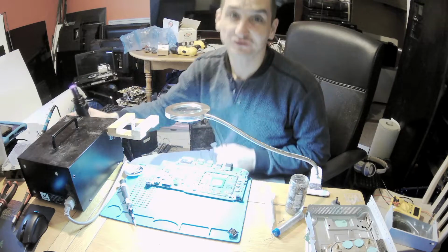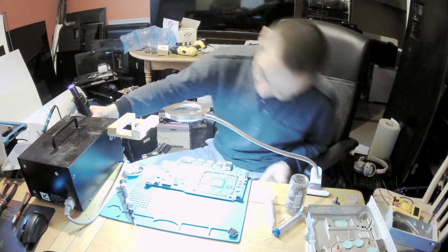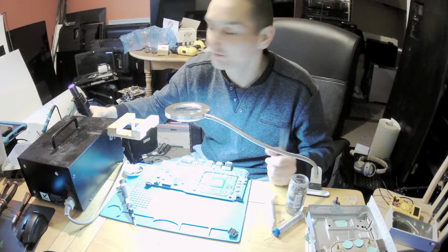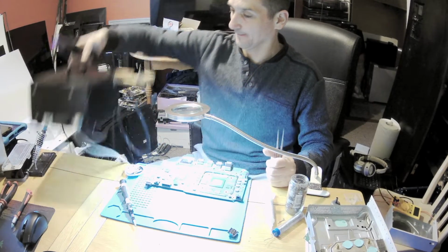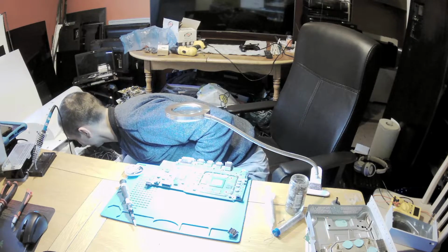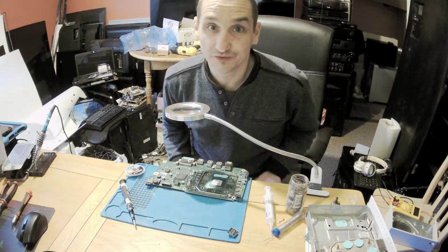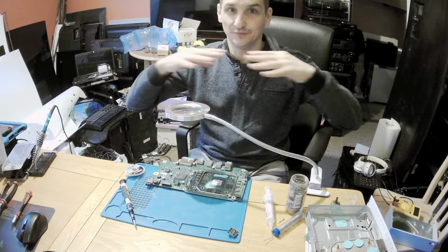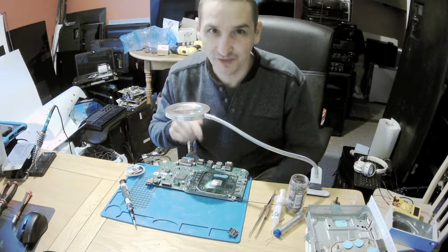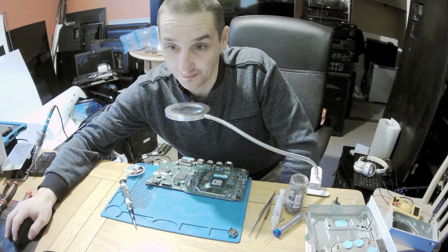But I need to finish it off when I'm back, because I will be late taking my boys to school. The port is sitting flat and I see that the pins are touching. I see some bridges, so I need to correct those bridges. If we left those bridges, of course it wouldn't work, because data would be plus to minus. No way, yes? So I'll do that one underneath the microscope for you, but that's it for now.